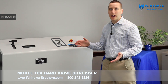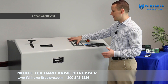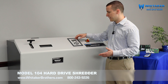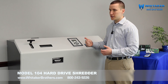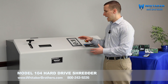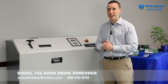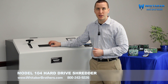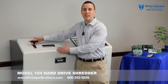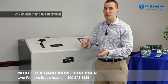Now let's take a look at the console and operation. As with most shredding apparatus, there's not a lot of buttons on this. We've got a standard console with an on and off button. It's got a list of different things that it can take: hard drives, CDs and DVDs, magnetic tape. You've got some options for choosing how it's going to shred, which really controls the speed at which the cutting edge inside moves. And finally, right here we've got the slot where we put in the drives we want destroyed. We bring this handle down and that safely drops it into the chamber without any spit-up going up towards the user or any chance of the user's hands finding their way into the cutting chamber.